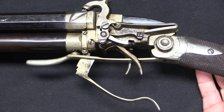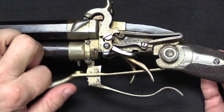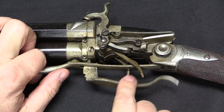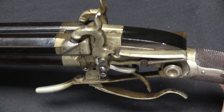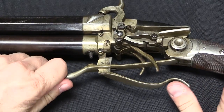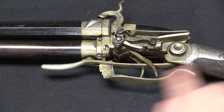Unless it's this one on the bottom, which is a whole different kettle of wax. The hammer here is integral to its own spring, and it's got a handle out here to use it. This is actually your bottom trigger. So you pull that back, hook the trigger into it like that, and then when you pull the trigger, it just pops out and lets this thing snap down and fire that bottom barrel.